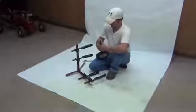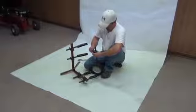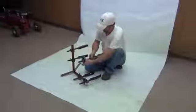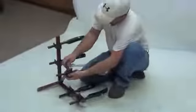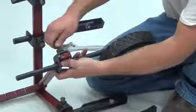Finally, attach the wheel assembly to the center arm with the last bracket. Adjust proper height and tighten. The depth wheel assembly is used to control cultivating depth. It is optional. Without the wheel, it is possible to straddle plants to cultivate closely to either side of the plant.